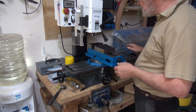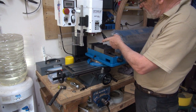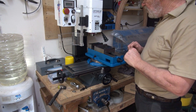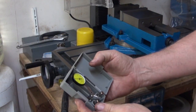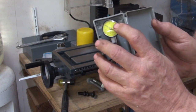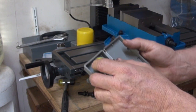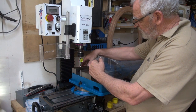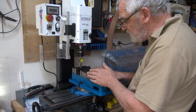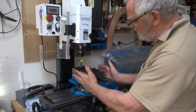I'll put the other side in shortly and then I've just got to true up this face to the vice. What I'll do for that — I think it's called a DTI which is a dial test indicator — I'll set that up and just make sure this is square to that, and then I can tighten the bolt on the other side. This is a dial test indicator and every notch there is one hundredth of a millimetre, so very, very sensitive. To get this vice accurate at the back, I'll put the two bolts into the T-slots and tighten those up. But seeing this has got a swivel table on it, I'm just nipping both of these up to hold the swivel.